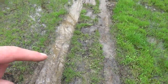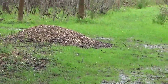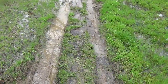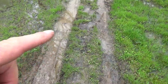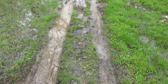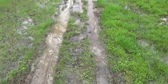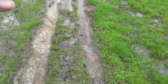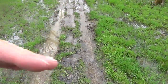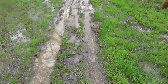I could add a lot of, we have the wood chip pile, and it was intended to help remediate this trail. So we could pull the planks up, put some wood chips underneath to add some elevation. If we put flats underneath, then the board will sag when you go over it with the heavy tractor. It'll snap it or whatever. So it really has to be a level thing.